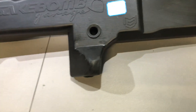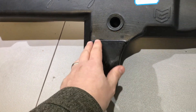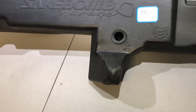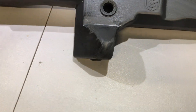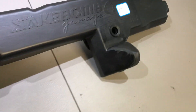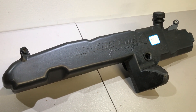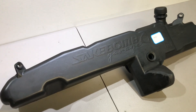One change you might notice — this sump went from kind of a few hard 90-degree angles in the latest 3D printing CAD file to this more rounded design. The factory recommended that for the purpose of blow molding, since those 90s are hard to fill in.